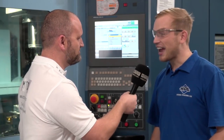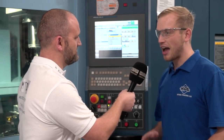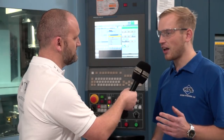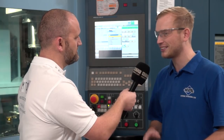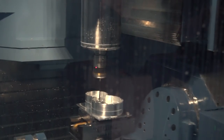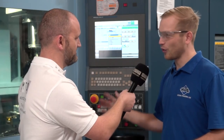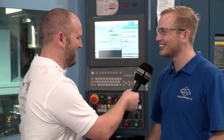So happy with OpenMind? Yeah, the support is absolutely brilliant. Anything we need, I just send them an email or give them a ring — we have engineers come in here. We have Renishaw probing on the machine and HyperMill copes with that really well. When you speak to a lot of the manufacturers of these CAD/CAM softwares, they kind of seem to shy away from the probing cycles. But with HyperMill, I've actually programmed it to bring the probe out, come down, measure the job, update the work offset, and then recut the job all on its own. You don't need to be here. No — that's the thing, it just runs itself.